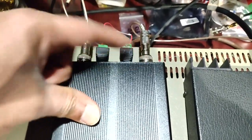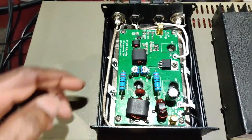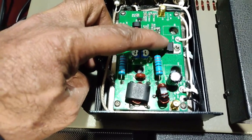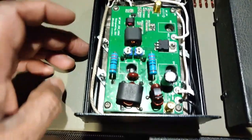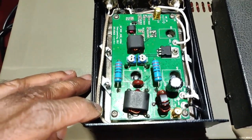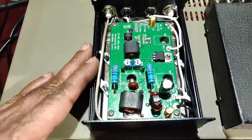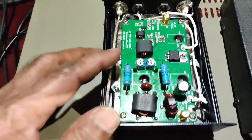I'm supplying that here, and this is for the final amp — the IRF 530 — with in and out connections. This is how the inside looks. As you can see, there are two IRF 530 inside, there's the driver, there's the nine-volt regulator for the bias and the driver, and there's a pre-driver. I have mounted it on a very hefty repurposed copper bus bar as the heat spreader, keeping the form factor small. Key down, this can operate for about five to seven minutes without any issues.